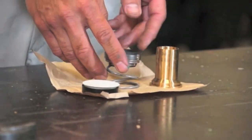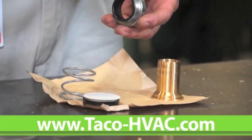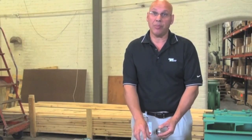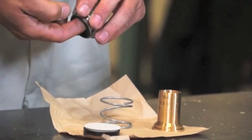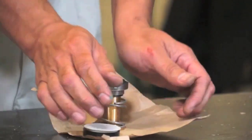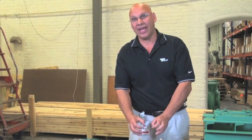There's a glue that comes in the seal for setting the working height of the pump. When you assemble this you have to lubricate — using a little bit of silicone lubricant put it right on the o-ring on the inside. This will allow it to slide down the sleeve. Very important. Once the seal goes in the pump and it's stationary, the lubricant will go away and then the glue from the seal itself will set it — and that will be the working height of the seal. Every single seal has that. We'll do the same thing to the seat: lubricate and put it in the cover.